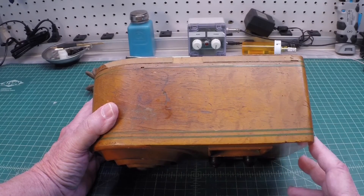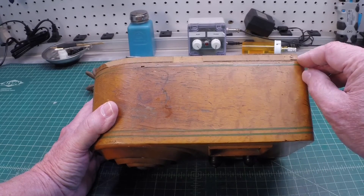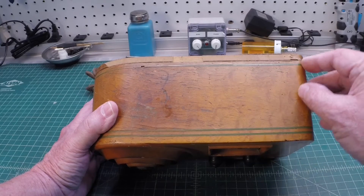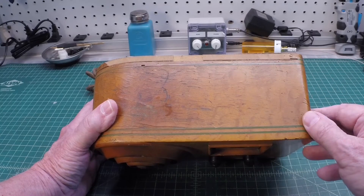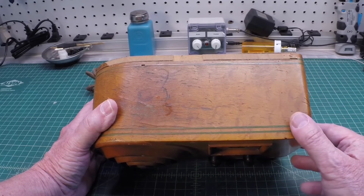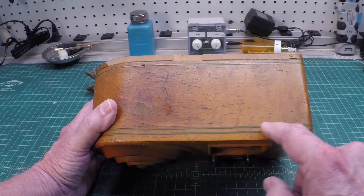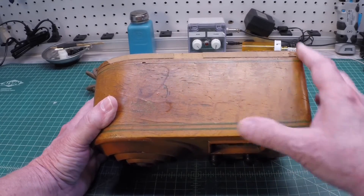The green inlaid was referred to as purfling material. I believe this to be plastic. We'll pull a piece of it out since it's already compromised and look at it, then find a suitable replacement or reproduce something that matches the existing purfling material.